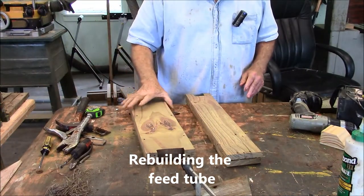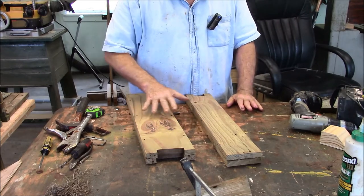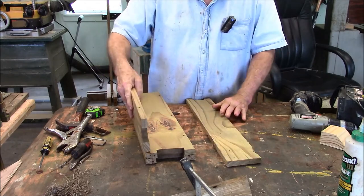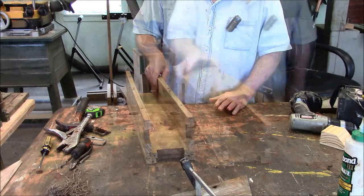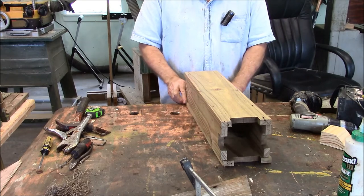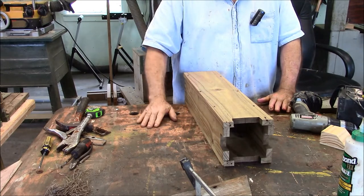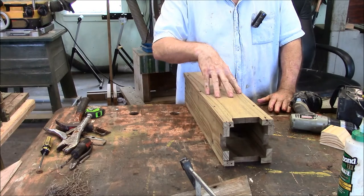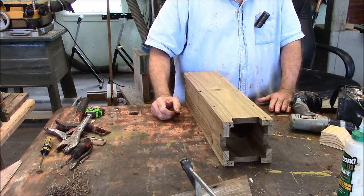What we have here is the central feeding tube. The whole bird house is built around this, and for this to work, these wide boards need to be identical, and these narrow boards need to be identical. The way it works is that one goes there and the other goes on top. If these aren't the same width and everything isn't correct about them, then this thing won't be square, and then the whole bird house will be out of whack. And that's one of the things I discovered when I took it apart — this thing was racked, which meant the whole bird house was racked. Okay, let me glue this thing up and keep moving along.